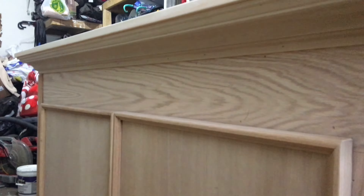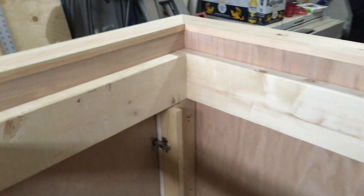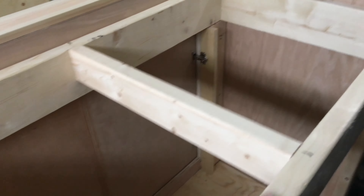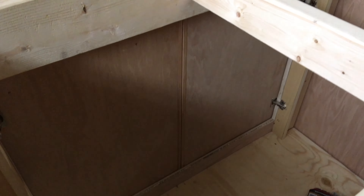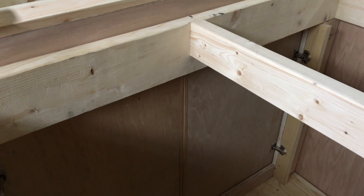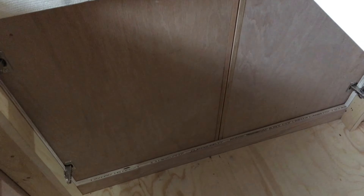We also have three-quarter inch solid oak wood trim as a baseboard finish. Inside, I framed it with 2x6 support header beams resting on 2x4s in the corners, with a middle brace on the sides. I avoided a center brace in the front by using the 2x6 header — it's strong enough to prevent any bow while keeping a nice open area.